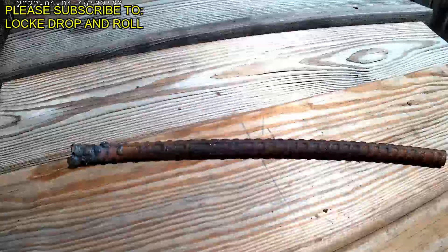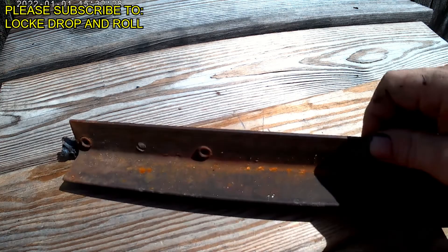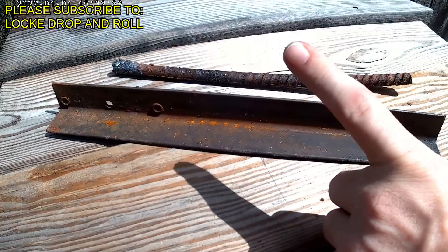Selecting your metal is possibly the most important thing. Rebar is not good, but it is good for practicing forging, which is always a good thing. Angle iron or bed frame — this is a piece of bed frame — same deal. You can use it as a backing for mild steel on a knife, or just for practice.